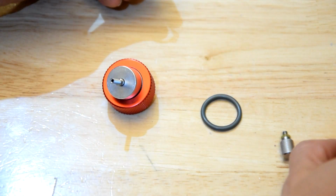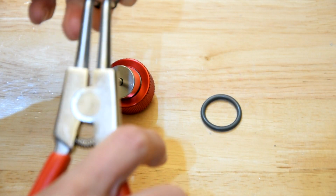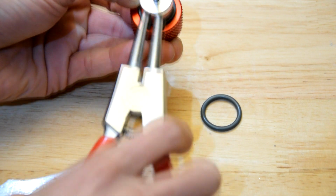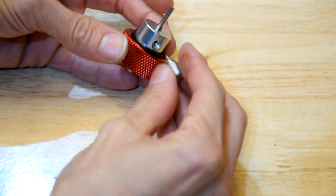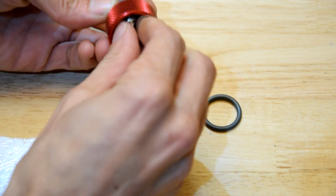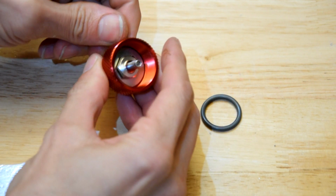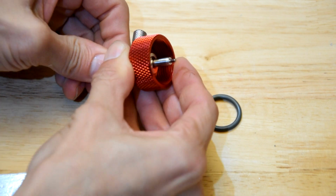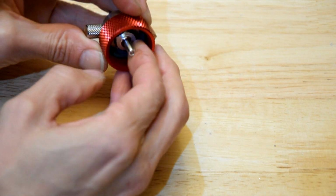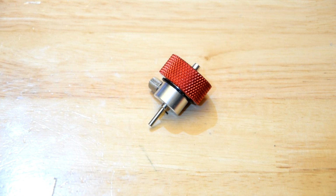So this pin is getting stuck down and the gas bottle itself is jamming open, so it's not shutting the gas feed off, and that is why some people are having problems with them. But if you treat them well and keep them lubed up and don't over tighten this into oblivion, and make sure all your O-rings and everything are lubed up nicely with silicone oil, you should have no problems whatsoever and everyone's going to have a fun time.